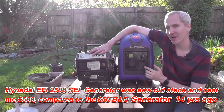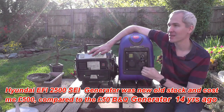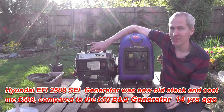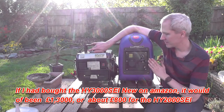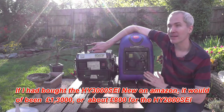Both of these grounding posts would have to go either to the steel hull or through the galvanic isolator, which in this case doesn't actually make any difference. We're not isolating a boat from anybody else. But in this case, I'll be plugging it straight into the 220 volt plug input on the generator.